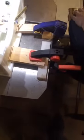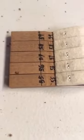Jig from the vibration machine. I was watching Brigham do it, and so what I ended up doing is I just took a straight edge and drew a line right across all of them to get the right bore distance. And what I'm noticing as I'm boring is the jigs seem to be wandering. It's not the table. Interesting. Maybe the table's not tight enough. It's tight. And so every couple things that I'm boring, it goes different distances.